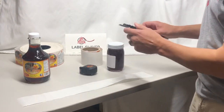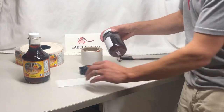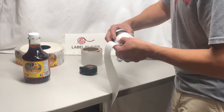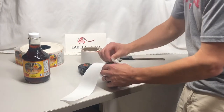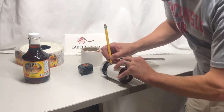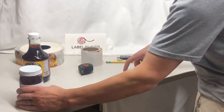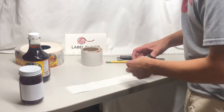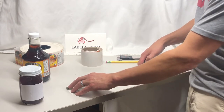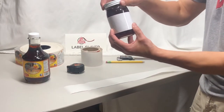If you don't have a caliper tool, one alternative is just to measure the circumference and divide that by 3.14. In this case I'll take the circumference of this bottle, wrap the paper around, and with a pencil mark right where it overlaps. If I lay that out flat and then measure the total distance, it's about nine and three quarters. Dividing that by 3.14 also gives the proper diameter of that bottle.